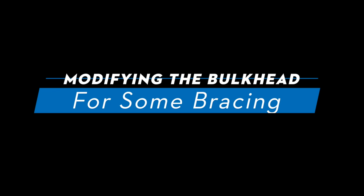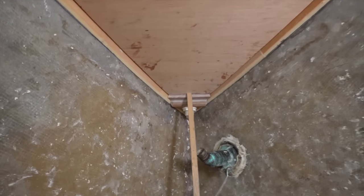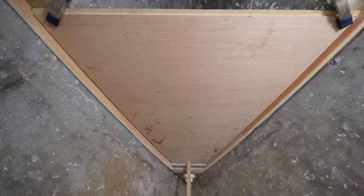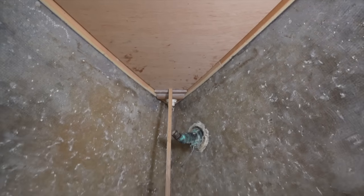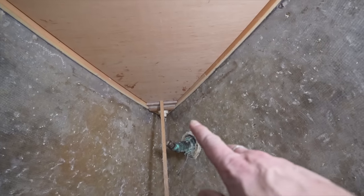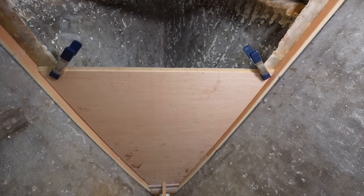The bulkhead is temporarily installed right now. One brace down below, two clamps at the corners. You'll notice I have the double thickness for where the through-hole fitting mounts, and then above that is going to be the two vertical sections of the bulkhead. Now, what I neglected to think about was that there is a shelf that goes in here, and the crossmember on the next bulkhead is right there. And so there's going to be a matching one over here. By the time I get the second bulkhead in and I'm able to screw it in from the other side or through bolt it, I'm going to have just that little tiny access hole.